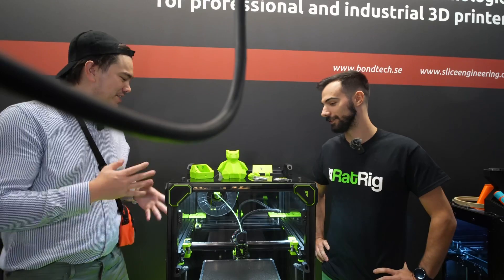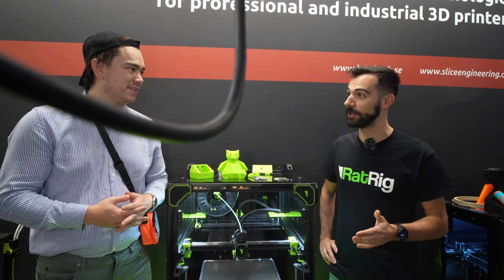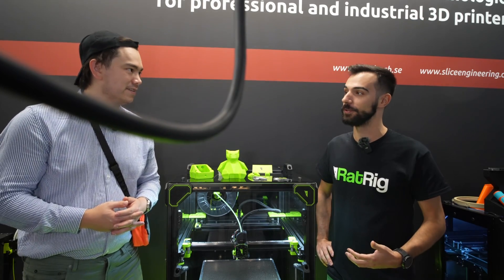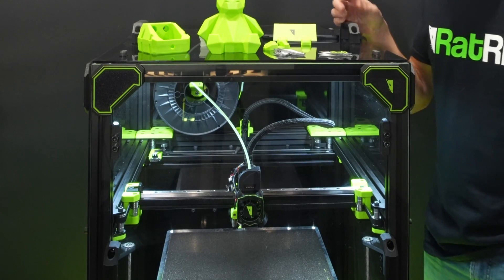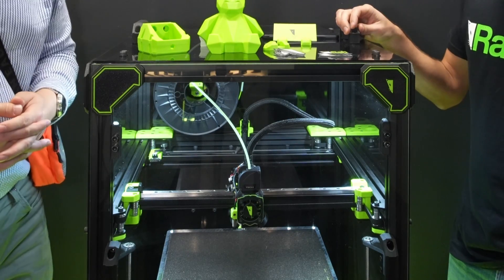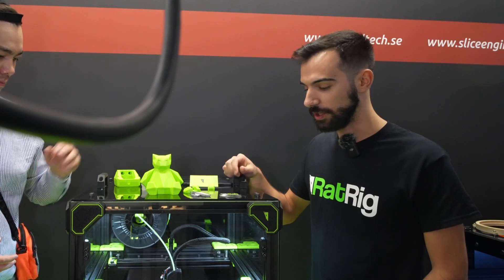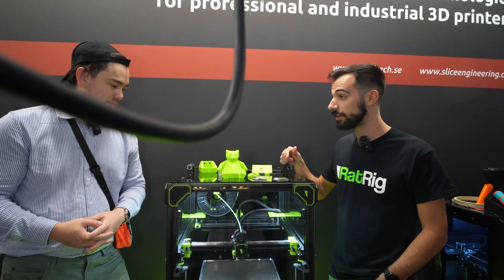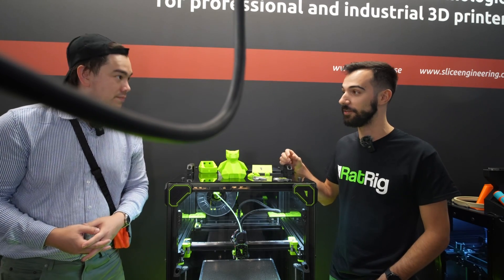I think so! What is this, a 300? Yeah, this is a 300 — this is the vCore 3.1 with a few community mods, our new tool heads, and a few mods of our own. So it's like an improved 3.1. This is a Core XY, of course. It's using an Octopus board. We have our new tool head with an aluminium plate, which allows for quicker accelerations and top high speeds. It's equipped with an LGX light with the Mosquito Magnum, so it's performing like crazy every day.